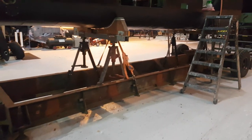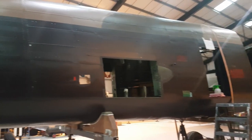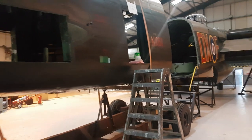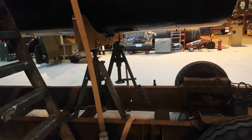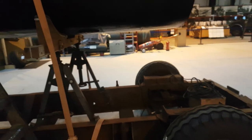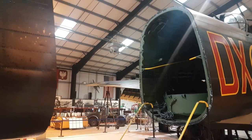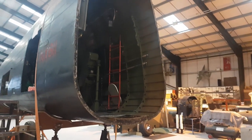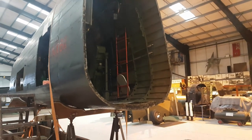With the rear fuselage withdrawn and the fuselage split from the main aircraft, the next plan is to start making a jig. We have a company coming in to look at the fuselage faces, the transport joint, and various parts of the rear fuselage section that we can attach to for the jig. That jig will hold the rear fuselage section to allow us to remove all the rivets and skins, break down the rear fuselage section, replace all the rivets, assess and inspect it for airworthiness, and restore anything that isn't airworthy — to be built back up into a completely airworthy section. This is part of the work going around the aircraft in bite-size, achievable pieces each winter.